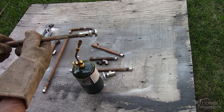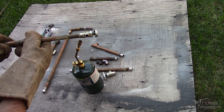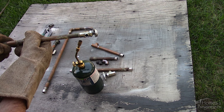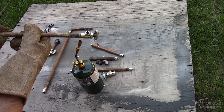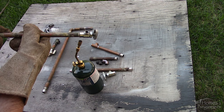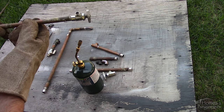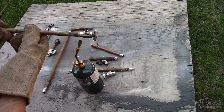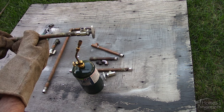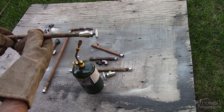The same process can be used on a valve and you can use the assistance of interlocking pliers. Just be careful when using pliers as you can mar or deform the pipe. When working with a valve, the amount of time required for heating up a joint will most likely be longer as the material is thicker. Some valves can be disassembled so you don't damage the seals, or you can also have a wet cloth wrapped around the valve portion to keep that section cool. If you're careful, other valves can be heated as is without any issues.